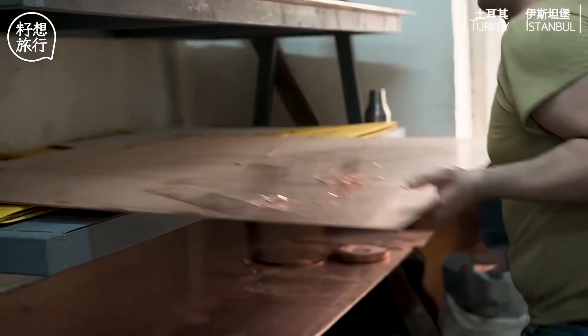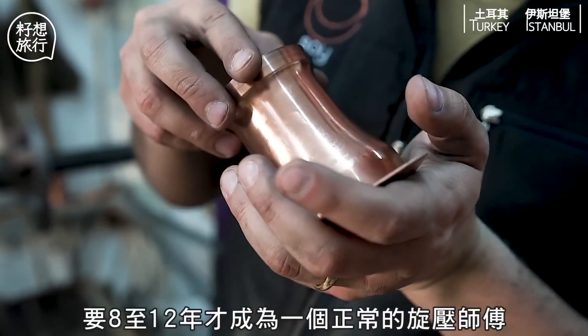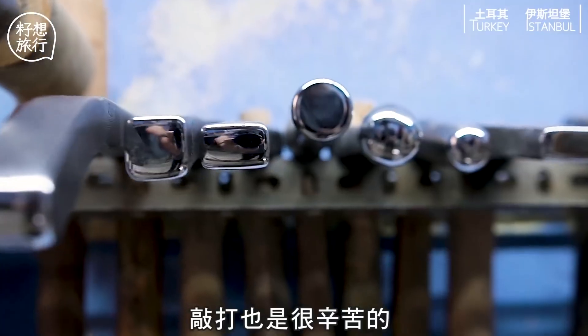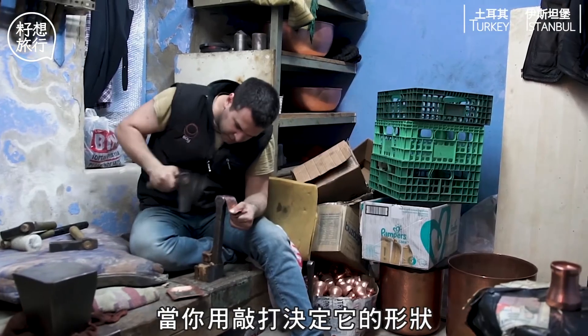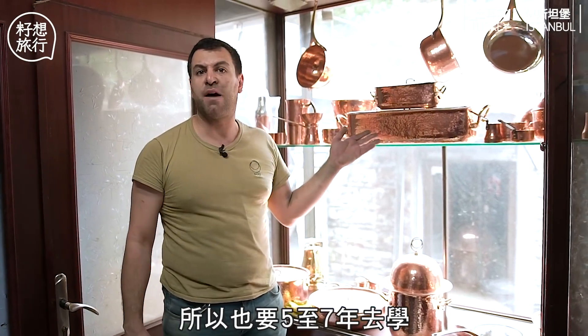We have hard work from the start. All of the parts are hard — spinning, for example, is really hard. It takes between 8 to 12 years to become an average spinner, and 20 years to become a very good spinner. Hammering is very very hard, a lot of physical constraint, especially if you're shaping by hammer — like this fish kettle here — hammering exactly on that space, say a millimeter. That also takes maybe 5 to 7 years to learn.